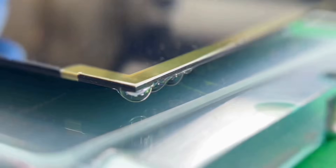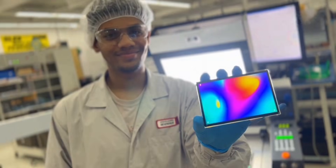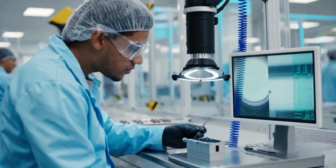This is the bonding station — we glue the OLED to the cover glass in a vacuum. Zero bubbles allowed. I set it on the pins adhesive-side down, close the lid, and the vacuum pulls everything perfectly flat. Next, inside the assembly cell of the camera module.